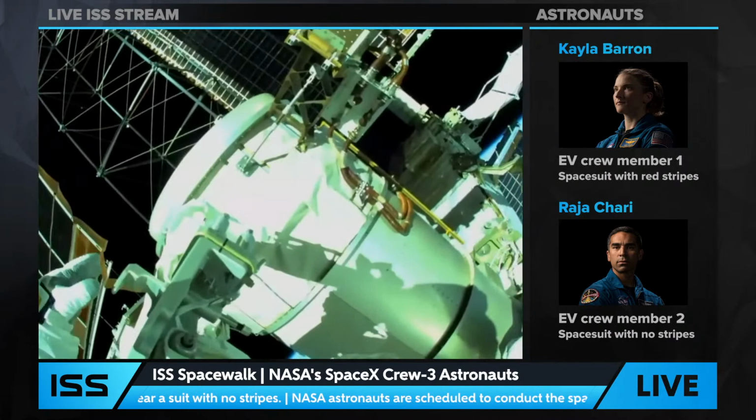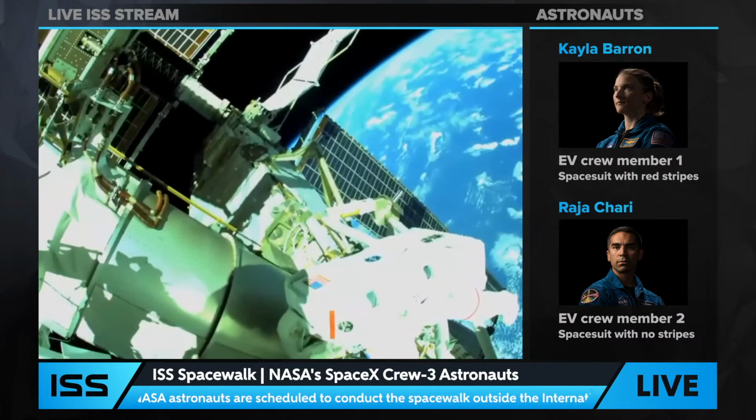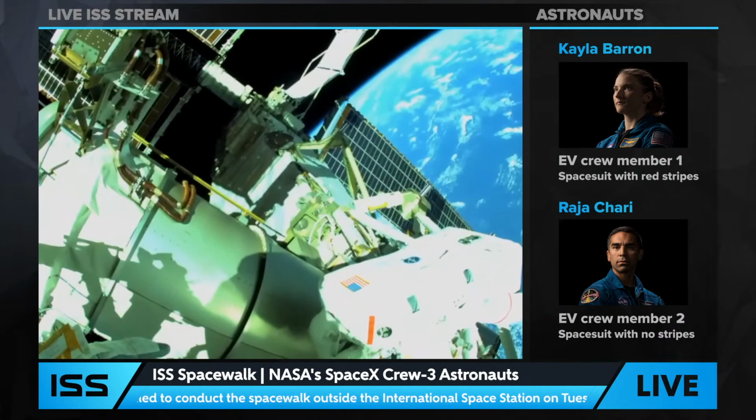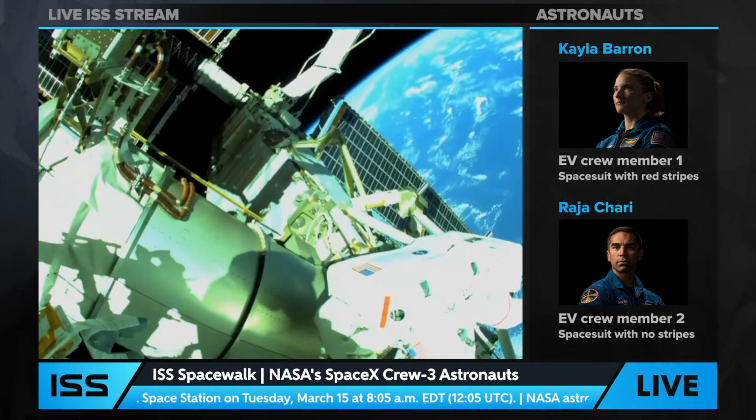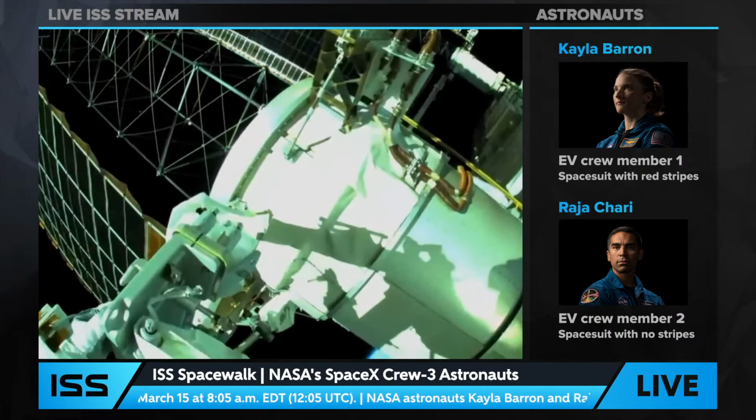And I believe I counted 8 turns there. I green light 25.4 on the torque. And actually, the PGT is telling me it was 7 turns. Okay, copy. 7 on the PGT, green light, 25.4. Okay, and now you are going to swap the 2-inch socket from the short PGT to the torque wrench, and we're going to final torque with the torque wrench again.